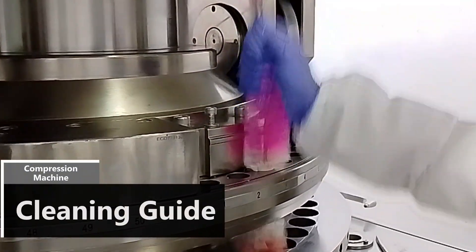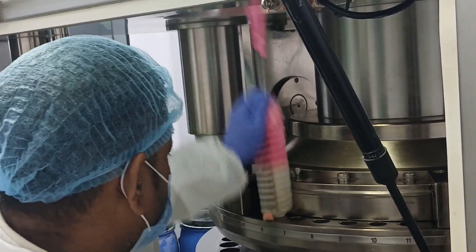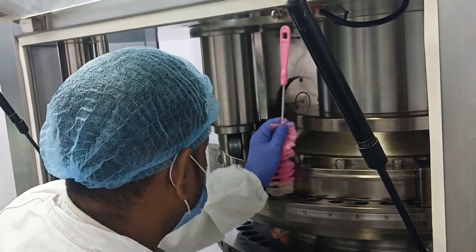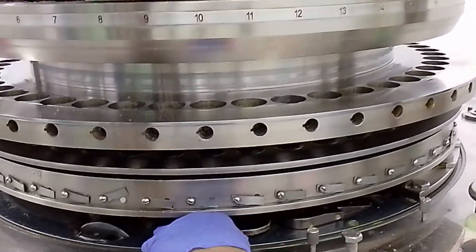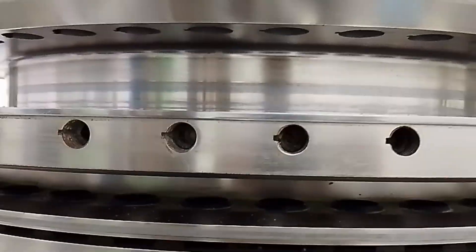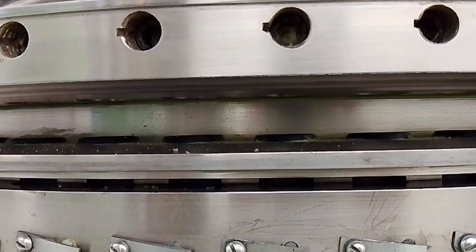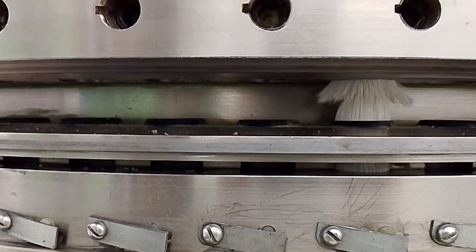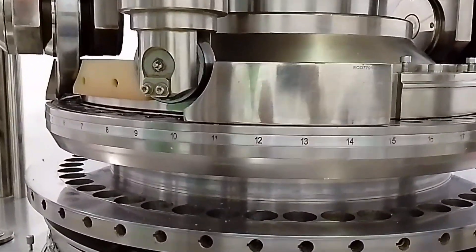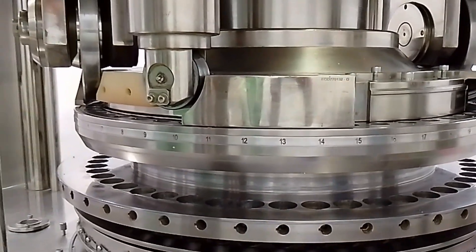After this you have to take a punch guide brush, and with it all the punch holes have to be cleaned properly. Remember that you have to clean the upper side, bottom side, and the hole of the die properly with the punch guide brush. Put the brush in the punch and you can clean the hole of the die directly above it. Particles are coming out from inside — we will clean them properly. You must do this so that whatever material is stuck, the particles will be removed. Keep rotating the machine completely and after cleaning every hole, clean the particles with lint-free cloth.